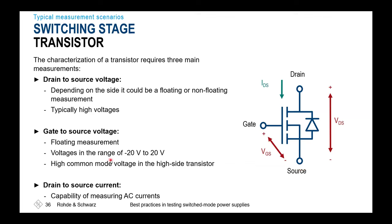On top of that, when investigating silicon carbide, gallium nitride gate drivers, typically these are floating too. So it's always depending on how high their isolation impedance against the environment and the ground itself is. And in dependency of this relation between the gate isolation and the isolation provided by the differential probe, you'll see more or less effects. So adding a high voltage differential probe without a galvanic isolation could cause you ringing effects at the gate source and might lead to destruction of your device due to the parasitic couplings inside the probe. So that's why it's important to be aware.